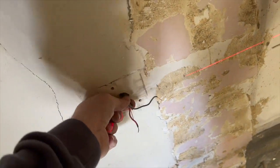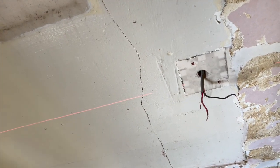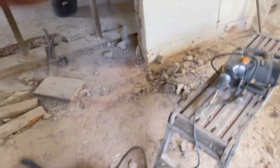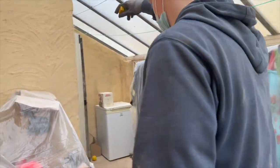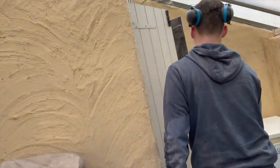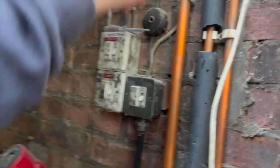That's a nice little find - where the rats have been eating away at the cable. We've traced it back - that is actually the tank stat for the immersion, which Ollie's just found on the other side. I don't know why this switch becomes live. Let me show you some horror shows. The builder's still taking the wall down, but that light in here comes off that 2.5mm which is that immersion feed.